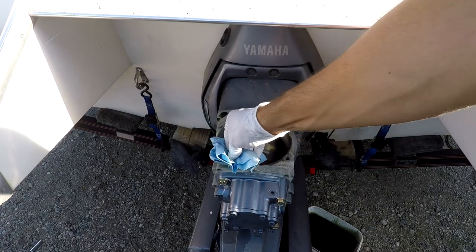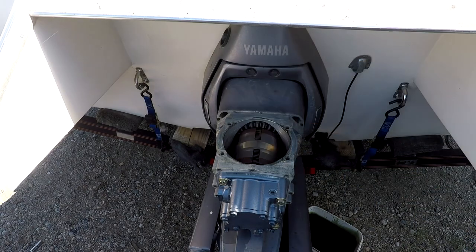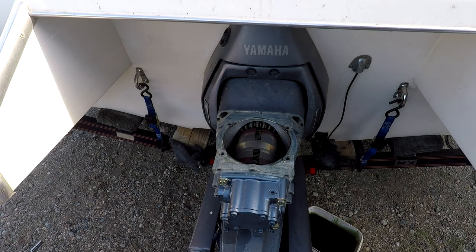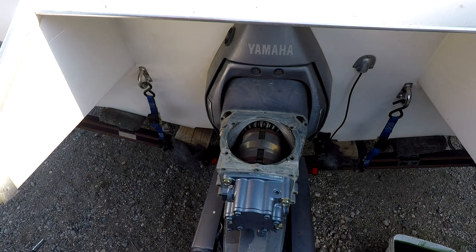Clean up some of the mating surface. Nothing on these bolts is cheap anymore because they haven't been made since the '90s. I'll lubricate the O-ring before putting it back on. If anybody knows what that green gear oil is, I'd be interested to hear. I was going to put in Amsoil 75-90 synthetic gear oil, but I don't think I'm fond of that anymore. I'll just find a conventional oil — I didn't have any conventional marine oil on hand, but I want to use the boat this weekend, so I'll just get some normal truck gear oil.